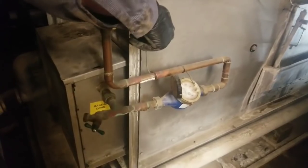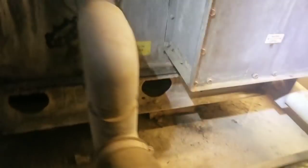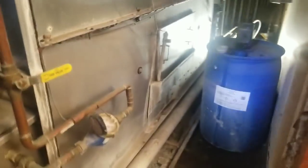Next, after we shut all the compressors down, we are going to shut the main water line down. Go ahead and shut the main water line down — what it does is stop the water from flowing into the float. Then we're going to drain the water by that gate valve. We've got to make sure we're not overflowing the floor drain, so we come over here and make sure there's no water overflowing.